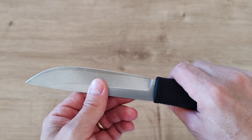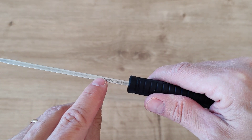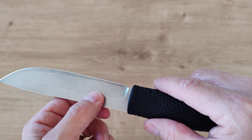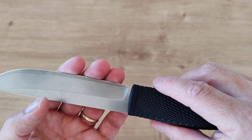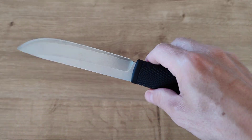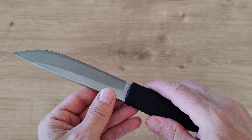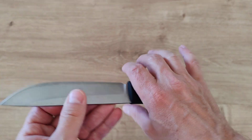The edge and cutting part is all S35VN — that's what you want for a very good edge. On the sides, you don't need super expensive steel because you don't really use the sides of the knife. The sides are there for solidity and minimum thickness. A knife with only one millimeter thickness would be destroyed. The 3G system is smart because you don't need expensive steel on the sides — just stainless there, and the expensive S35VN in the middle where it matters.